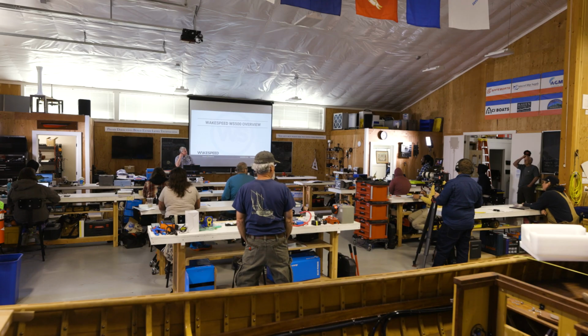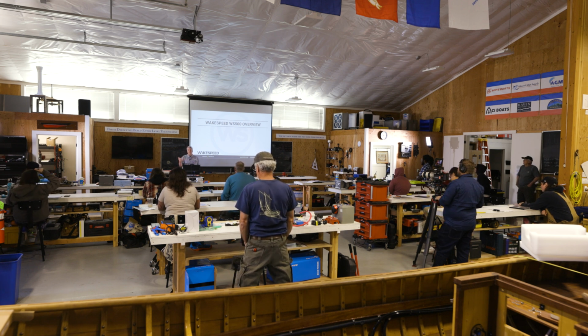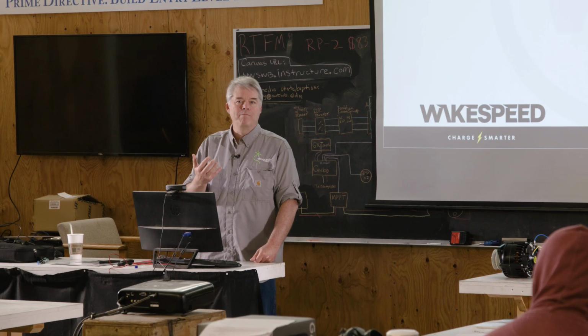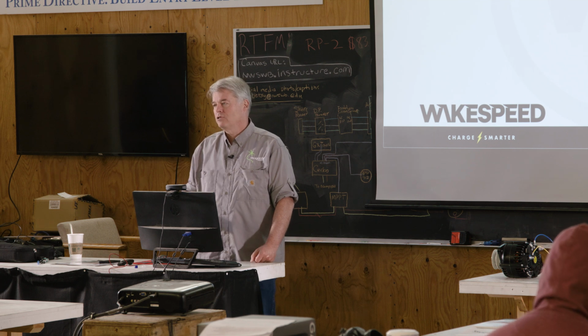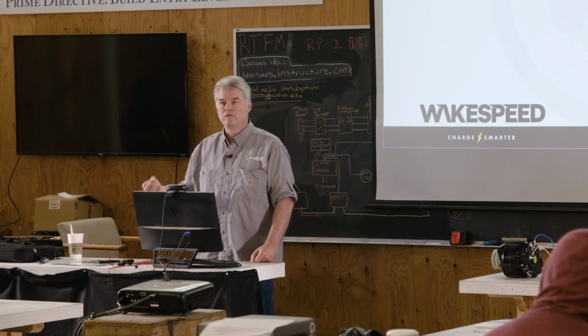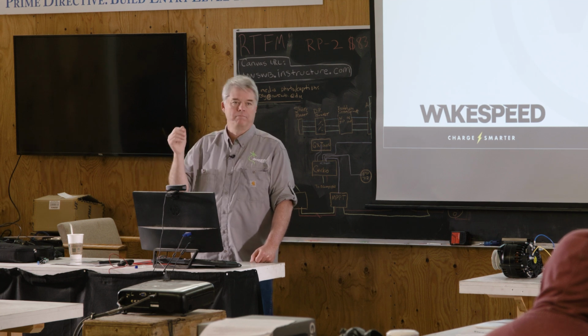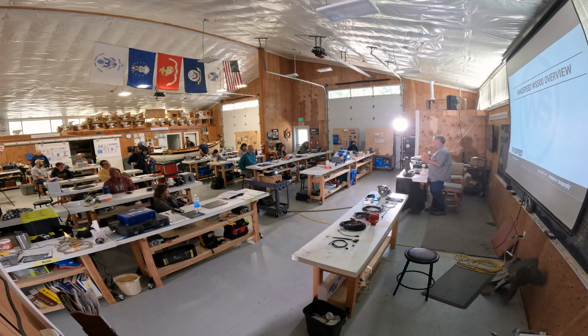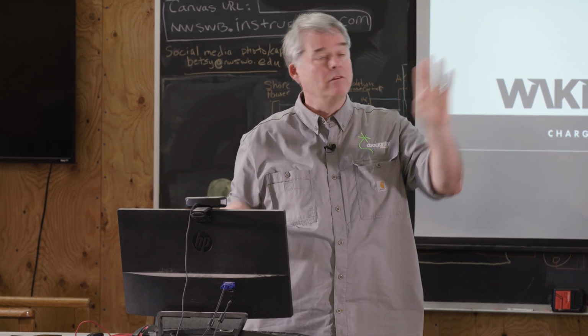We were just having a sidebar conversation again about the BMSs and, you know, the different ways that they are deployed. So I want to come back to this topic a bit. Bottom line, all BMSs, they will monitor the battery cells for hazardous or damaging conditions, and they will pull the ripcord. They all do that. And it doesn't matter if it's a BMS inside the battery or if it's a BMS outside the battery with some communication, or they've taken that BMS hardware and split it in half electrically and put some in the battery and some out. Doesn't matter.